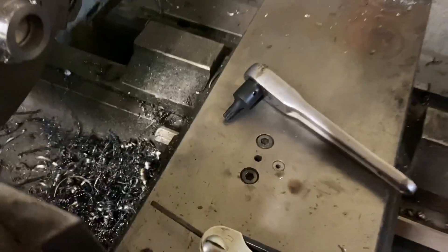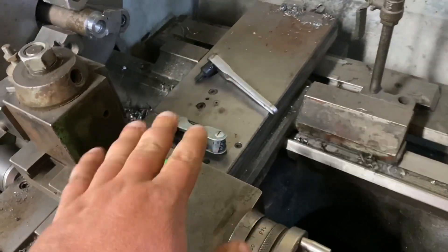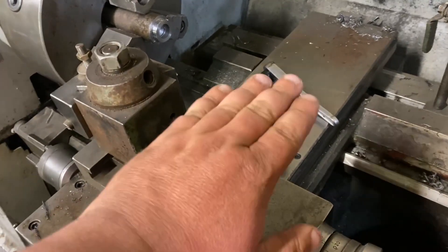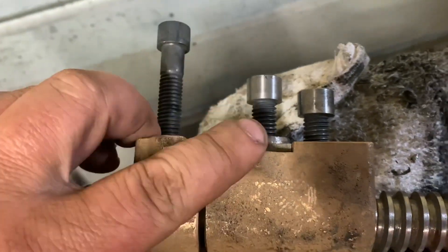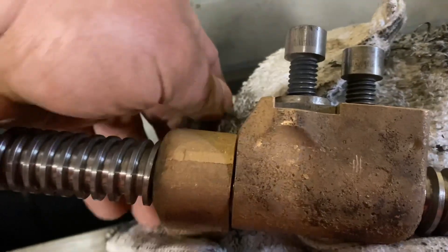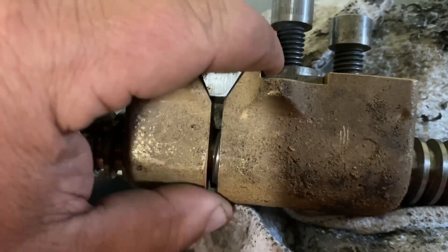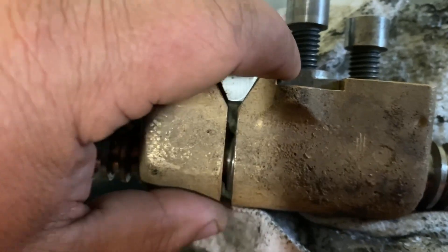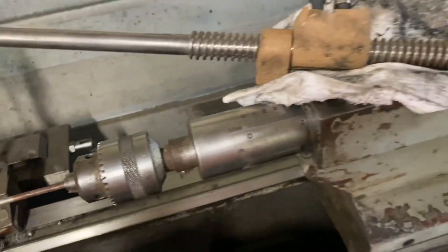What you do is you've got these two screws here that are holding down what I call split nuts. Most larger lathes have a means for adjusting the wear in the cross slide. A lot of them are set up like this — this is off the big lathe — and what's basically happening is you have the bolts that hold it in, and you have this little wedge, and you have a bolt on top that pushes that down. There's not a great deal of spread in these.